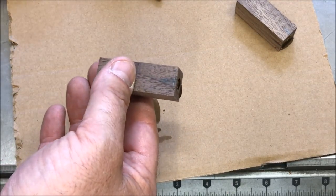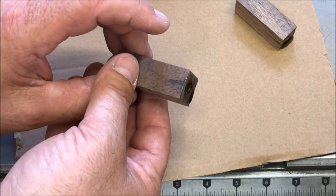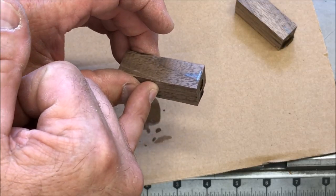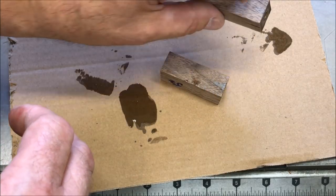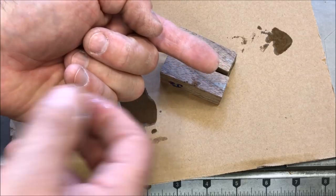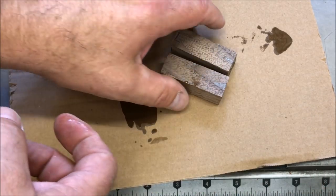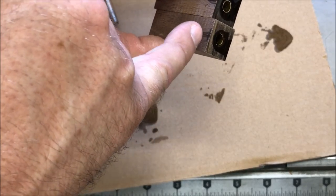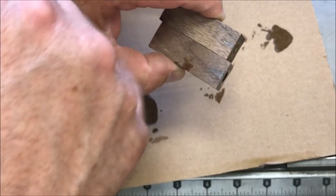You want to be rather quick with this process, because if the blank has any dampness at all, I've seen those tubes grab and not be able to fully insert them. You'll notice my hash mark here and here — both of my tubes were laying facing the same direction, and that is the direction from which I plan to insert the tube. You always want to insert the tube from the center of the blank out to make sure you're removing the least amount of material from the center, so you get the best alignment of your grain.